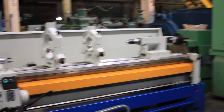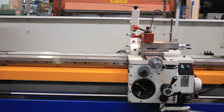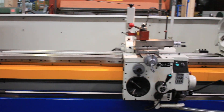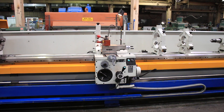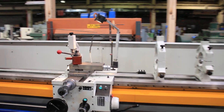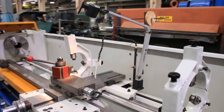And that's it basically. So the machine is a 20 by 160, with 27 inches in the gap and 160 inch centers. Taper turning attachment in the back of the machine as well. Two steadies and a follow rest. Let me just show you the taper turning attachment — and you can see the bracket as well.